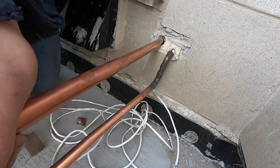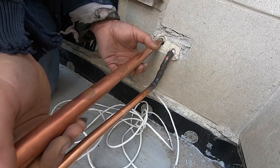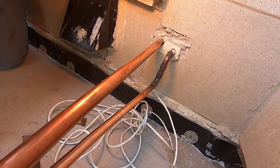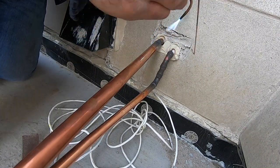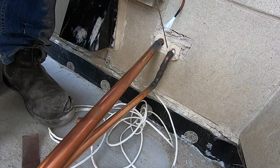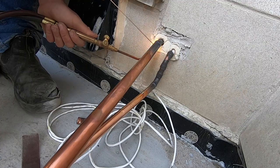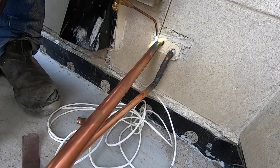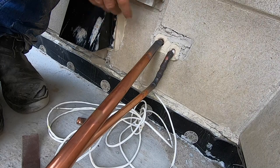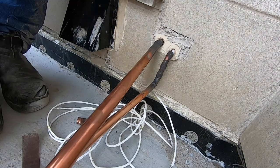After I braze it I can manipulate this in a way that I'll bend it a little bit straighter, because over construction things move. I'm going to braze that up - I've got my nitrogen flowing in my discharge inside. That's pretty much the first bead on. You're going to let that dry; once you see the black spots disappearing you know it's good enough to adjust or move the pipe. Until then, don't move it and crack it. I'll bend it how I have to.